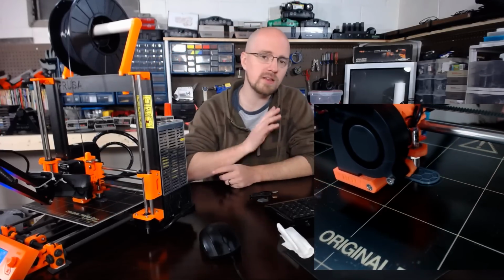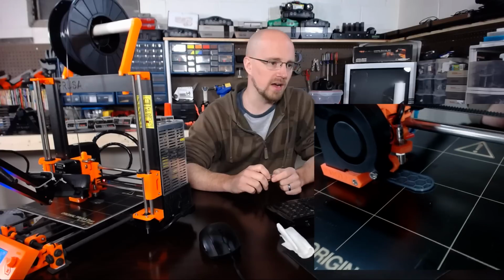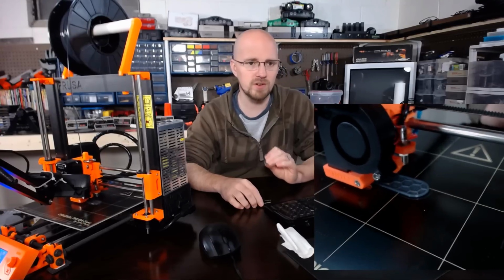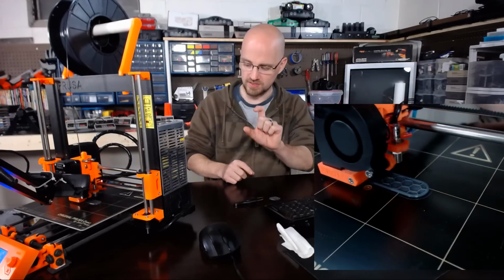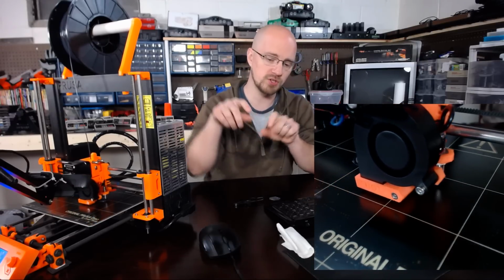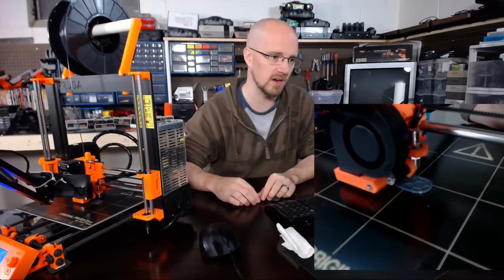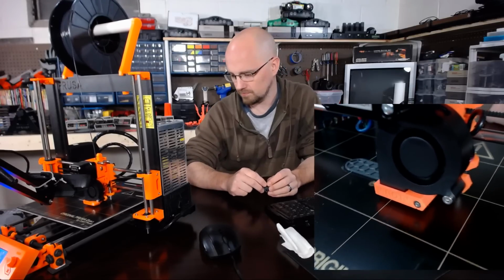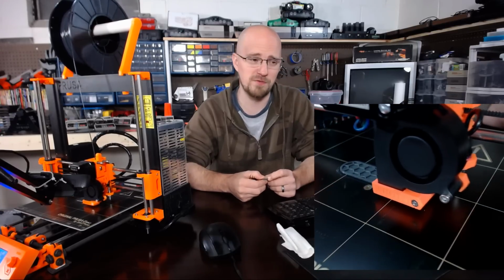But I'd at the very least like to upgrade to one of the brackets that attaches with 3 mounting holes. And then ideally, I'd kind of like to either get someone to make a piece or to do it myself, which I'm kind of afraid to do because I'm a noob. But actually make a piece that connects with both of the threaded rods, connects with 3 bolt holes like it should, and then also has little bridge pieces that come off and brace against the threaded rod so it can't rock from side to side to get out of 90 degrees with the belt. I think that would probably be the best design given the way it's mounted there. But I don't know when that'll happen exactly. Hopefully soonish.